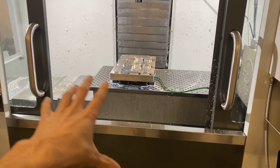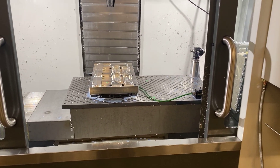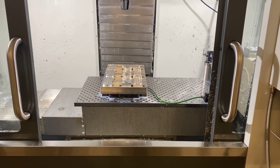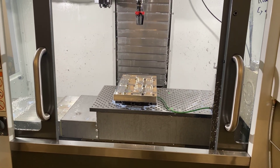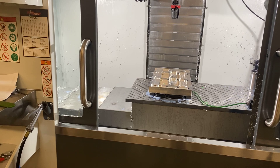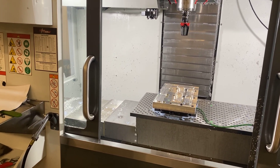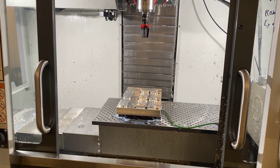The arm is coming with a little control pendant — basically a control panel for the robot. You do have to have it hooked up to a computer for programming, but you can set up a UI on it so you could have a whole workflow to walk through to recover from faults. As far as part feeding, I'm still trying to figure out how to grab from a grid, but I'm really just planning on having a stack of raw parts. There's a little thing that kicks one out, a sensor sees that it was kicked out and tells the robot it's good to come over and pick it up. The robot picks it up and maybe the next one feeds out automatically.